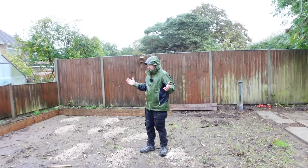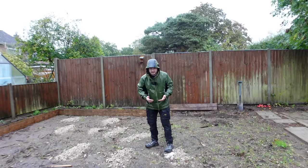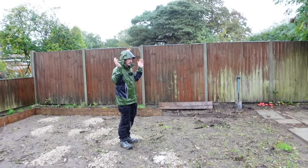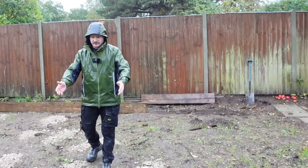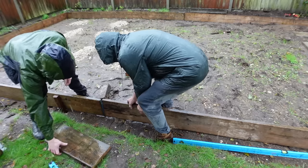Getting harder, and we have got half of the shuttering done. It's horrible working in this, to be honest. I don't recommend it, so don't do that at home. Because the pad's going to be 6 meters long, we need our deals to run 6 meters long, so we'll just put some joiners in to extend them, and carry on moving in that direction.